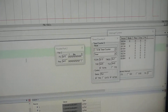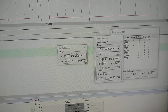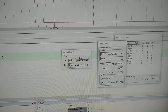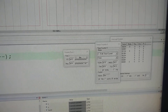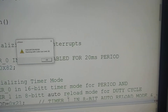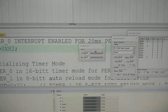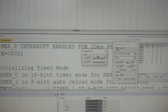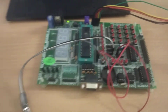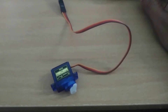When I press the close switch, you can see the width is decreasing. After downloading this code into the kit, when I press the open button it opens, and when I press the close button it closes. So opening and closing — the position control of the servo motor from 0 to 90 degrees is working fine.